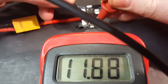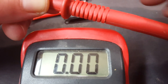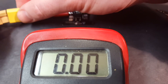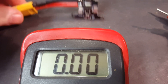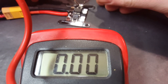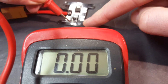Just for kicks I'm going to give it a shot on a 3S battery as well. We're going to try this on an almost fully charged 12-volt or three-cell LiPo. Plugging that into the PDB and checking the 5-volt BEC — we're getting still almost right on five volts. Very nice.